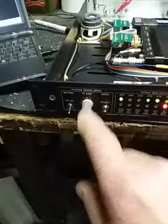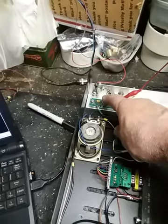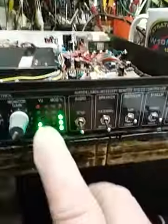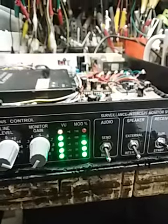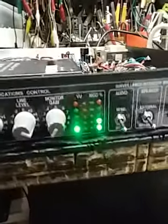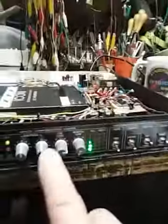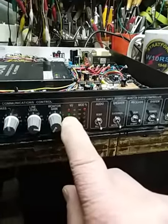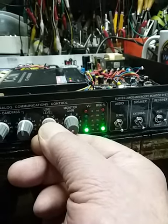You can have a good idea of what you're doing based on the numbers here. This is all set up so that back at the antenna, 50 microvolts — which would be S9 for a ham — coming in with the RF gain at full will give us, in the audio conversion from the D-to-A, zero dB average, which is 0.77 volts into a 600-ohm line. That's adjustable with the line level control, but it is calibrated. So 50 microvolts in with everything set correctly will give you zero dB on the line. The zero dB indicator is on fairly solid and we get some flashing into the red.